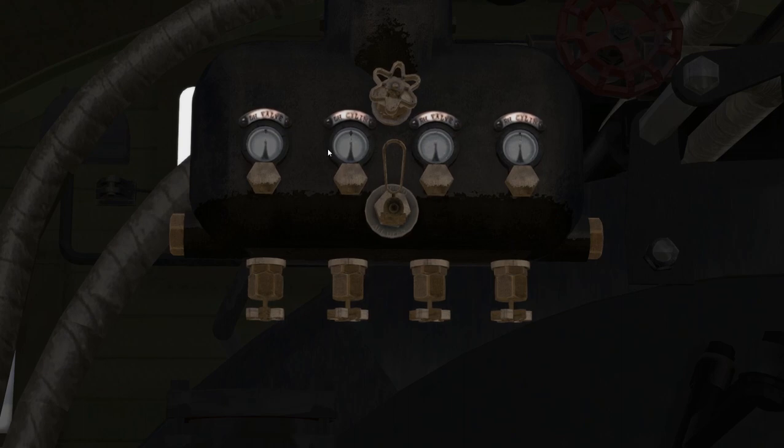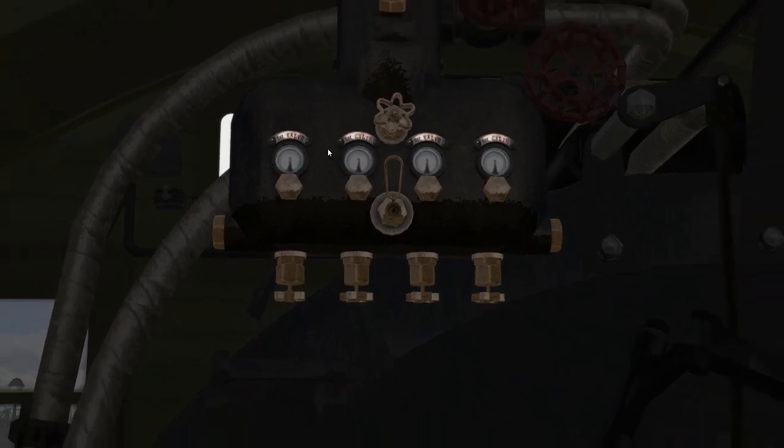Sometimes these are called weepers, sometimes they're called bullseyes, and they can be one or they can be four. We have one that, we don't use it, but I think is three. It's been a while since I've seen it. It's an old style. It's got the brass oil reservoir up here. It's actually kind of nice. But these things are a pain. They'll hydrolock, they'll gum up, you know, they won't work. That's why they got away from these things and used pressurized lubrication.